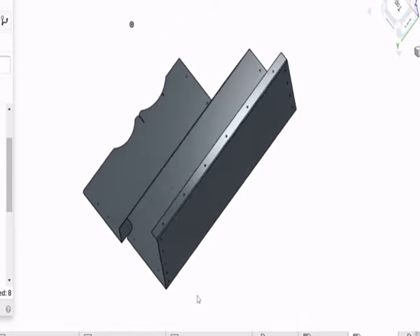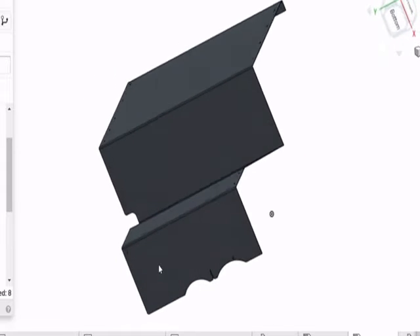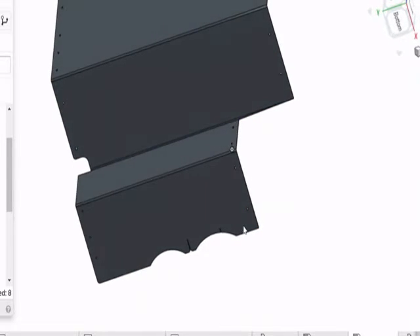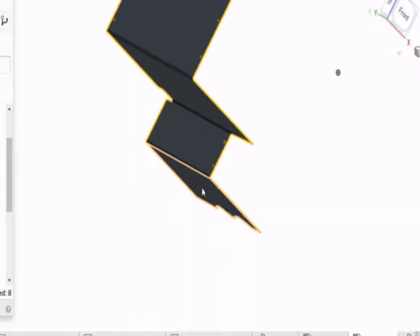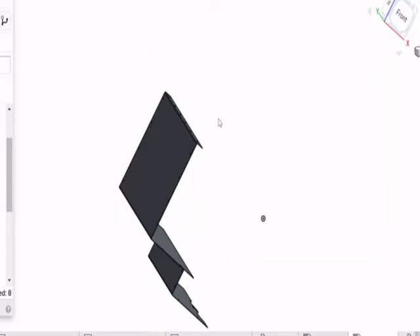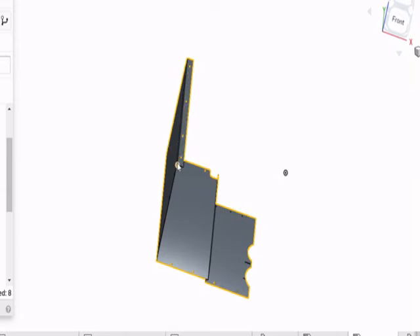This is probably the biggest piece in the kit. It's going to be a big piece of sheet metal with a series of perforating lines. These are going to go underneath the exhaust manifold on the right-hand side, underneath the muffler in that area. We've got a bend here — this is bent up 90 degrees and then back this way so that this part down here and this surface are parallel to each other with a 90 degree wall in between. Then the big part of the panel is bent 90 degrees this way. Looking at the end, you can see the bends — they're all 90 degrees, a zigzag kind of shape. Then this long flange up on here bends over 90 degrees.